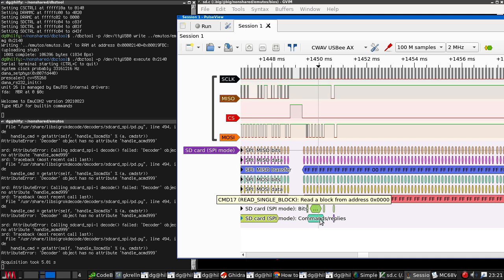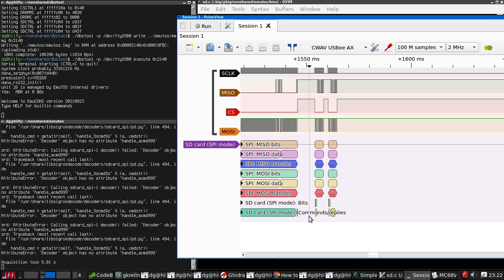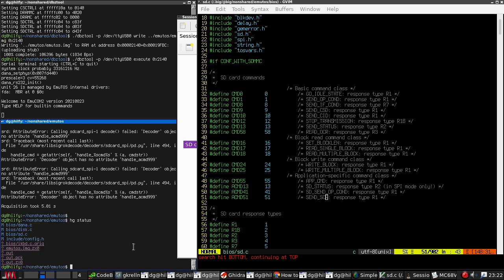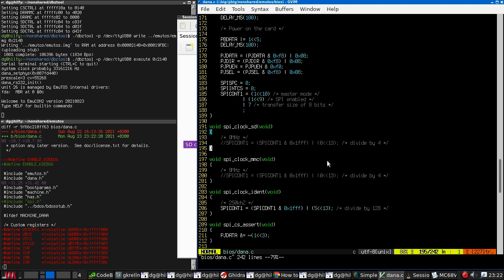And here is command 17, read single block. And there, this green thing, is our very first sector of our own, and it's the partition table. And then nothing else happens because there are no Atari partitions on this card. Right, well, that took forever, and I am not entirely convinced of...